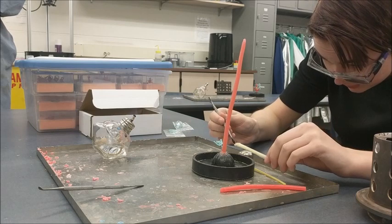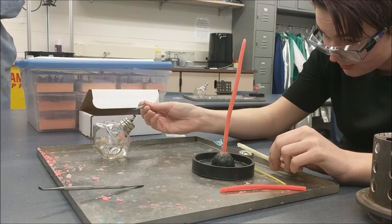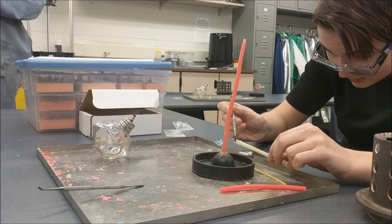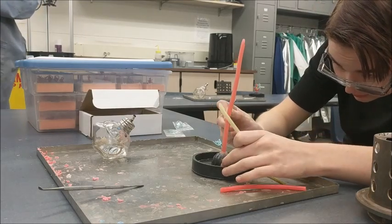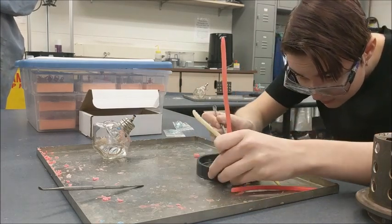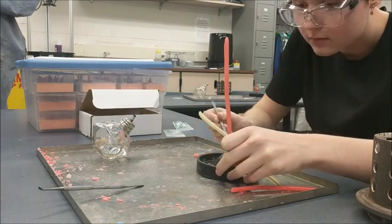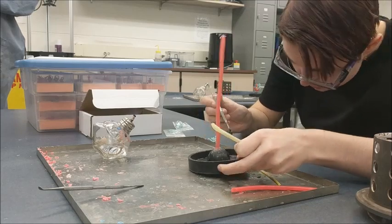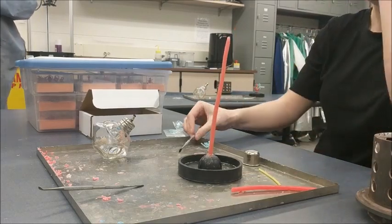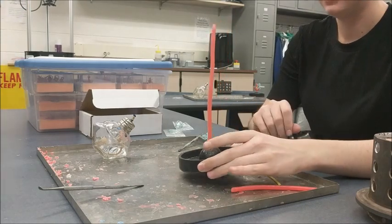If the connection isn't great, you can melt a little bit more sticky wax on there — easiest if you heat up the tool, melt some wax to the tool, and then attach the wax to the part. You want these parts to be angled up at about a 45 degree angle because eventually when we go to pour metal we're going to flip the whole thing upside down and metal will get poured into that black cone. If they're angled up in this orientation, they'll be angled down when we pour, and the metal likes to flow with gravity, giving you a better chance at successful parts.